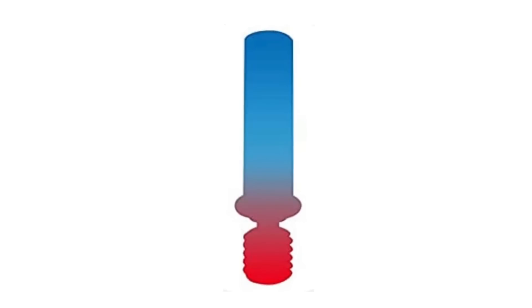But it's more than just blocking the PTFE tubing — that small tube actually forms a heat break. Metal absorbs heat the same way a sponge absorbs water. A smaller sponge can only absorb so much water before it saturates and won't absorb any more. Similarly, a smaller diameter piece of metal will saturate with heat, therefore blocking any more heat from going up into the upper tube. So it forms a break between the hot heat block and the tube that's holding the PTFE tubing and the cool filament.